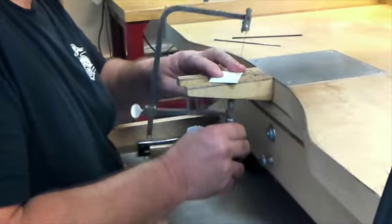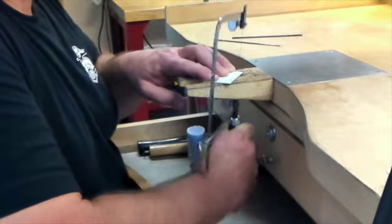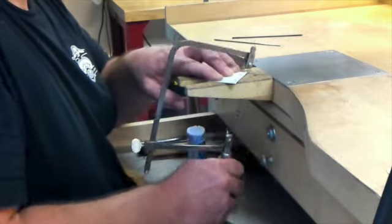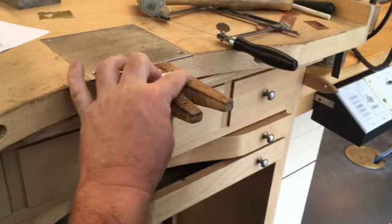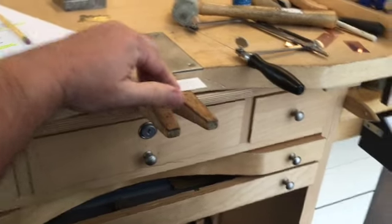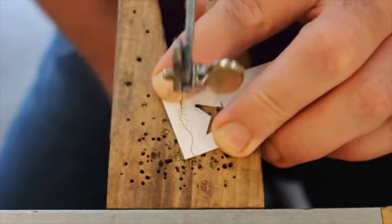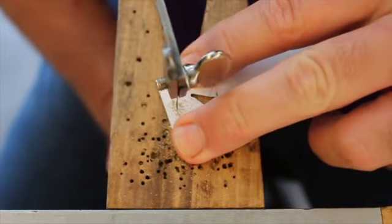Your dumb hand is your gripping hand. The saw cuts on the down stroke and the bench pin supports the metal as you cut. The job of your left hand is to keep the metal from popping up off the bench pin on the up stroke while maneuvering the metal to feed it into the blade — find the best support, avoid cutting into the bench pin, and avoid being cut by the saw. Use any part of the bench pin that gives you the best support, usually at the narrow end of the V-shaped opening or off the edge on the smart hand side. Use a pinching grip with your thumb whenever you can; you have a lot more strength in your grip than in your shoulder. You can bring your fingers in close to the blade or even in front of it if needed without a lot of risk.